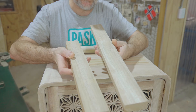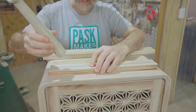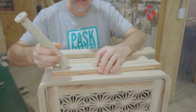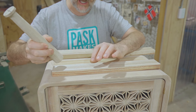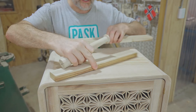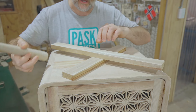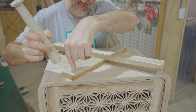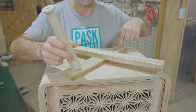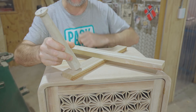To fix the legs to the underneath I've prepared these pieces off camera and next I need to drill holes in those for the legs to slot into. I want the legs to angle forwards and out to the side as well, and that's quite tricky to set up to drill the hole at the right angle. So instead I'm going to put them across each other and drill a hole with one angle along the center line of the piece — that makes it a little bit easier to set up and the legs will still face forwards and out to the side.